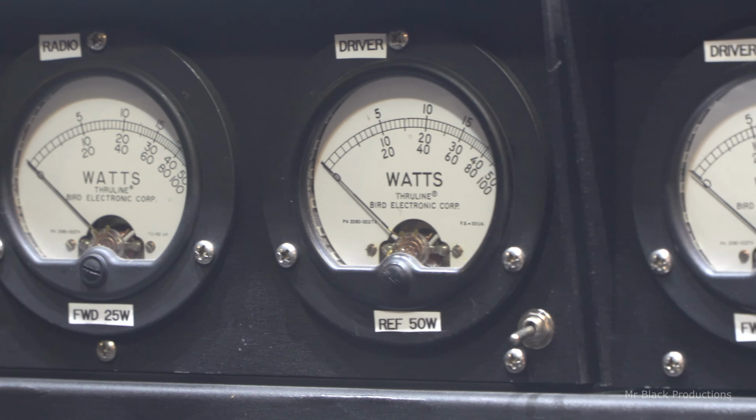Okay, so back here on the back of the alternator, on the back of all Leece-Nevilles, you have 2 major mount points. And on this particular alternator, that's where they're utilizing the ground hookup. On the smaller amp alternators, you'll see that they'll have a secondary ground post. Because this is in the 300 class range, that has been deleted and it goes directly just to the case. So we're wanting our electrical ground at this point. We've already bonded the motor with big, you know, 1 inch wide or better ground material in multiple spots.